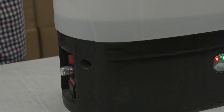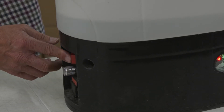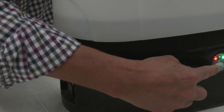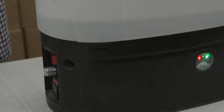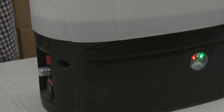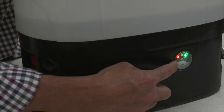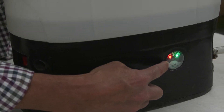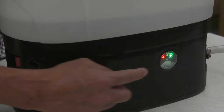The number two reason why you get no pump noise when the voltmeter lights are on is a bad battery. It doesn't happen very often. There are three things that will help indicate it's a bad battery. Number one, in this case it shows a green and a red light, but if your battery is low voltage, the green light will be off and you'll have just the red light on.